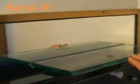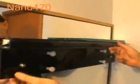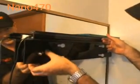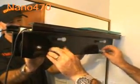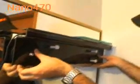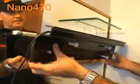Once I've done that, I'll insert my light into the groove on the shelf, and what this will do is cure the adhesive. Now I can see that my dribbles are going a bit milky, which means that they've cured enough for our shelf. Let's give it a bit of a wiggle, and it's feeling pretty solid. I'll turn the light off, and just by getting your fingers underneath those suction caps, I'll first of all wind your stabilising bolts out, and then get your fingers underneath the suction caps, the little flaps, and release the pressure of the suction cap and take it away.